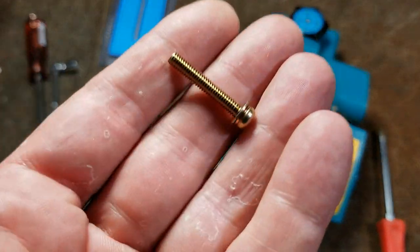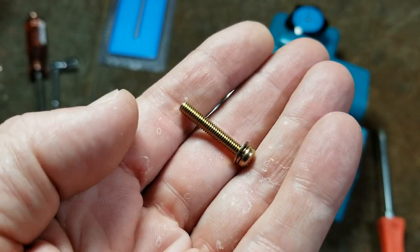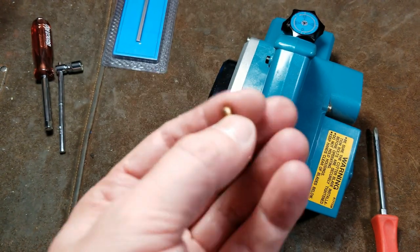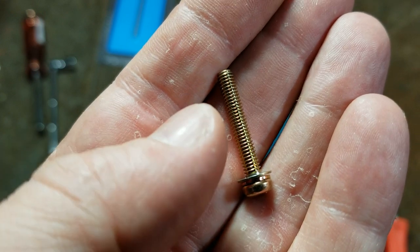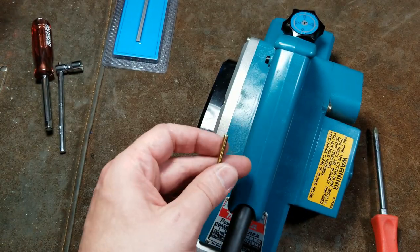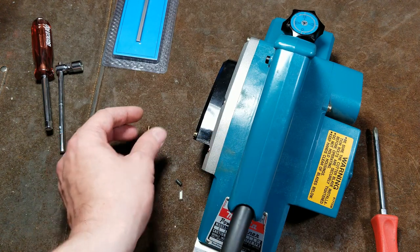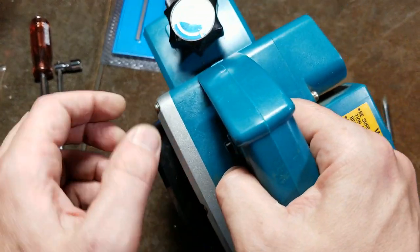And in case anybody's wondering, yeah, this is something Makita does, it was just a standard. They'd use fine machine thread screws directly in the plastic. The reason that's a problem is because with fine thread screws, the threads are not cut quite as deeply, so they don't work as well in plastic. But what Makita does is just make extra deep holes for them to thread into, and I always thought that was interesting. We'll give it a quick bump here to make sure my work is okay.